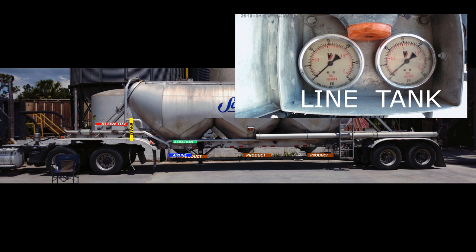Now the tank pressure is building up in the tank. If you didn't shut the air line before starting the blower, go ahead and shut it now. We are going to be pumping between 10 and 12 psi today. We can't go past 15 pounds per square inch, because the safety pop-off valve will open up. So this will give us a 3 pound bumper to catch any possible pipe plug ups. Okay, the tank is building up pressure by air being forced through the aerators.